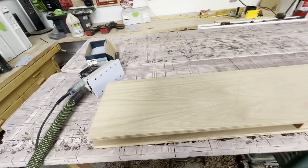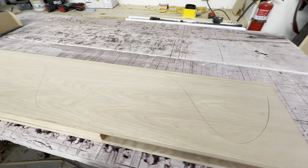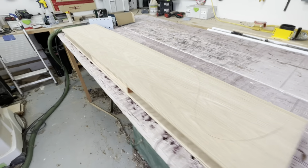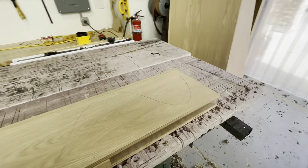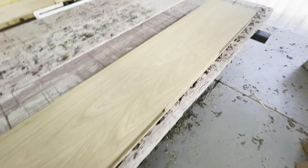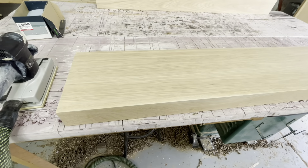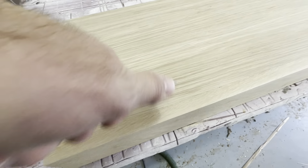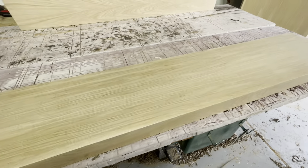All ready for the finished sanding. I'm going to use 150 grit. With Festool Granat on white oak, that's where I want to be — it's a pretty hard solid wood, it'll feel really smooth, and 150 grit still lets it take in quite a bit of color. I've got the pencil writing on there as my indicator of when enough is enough. After sanding, I'll take my air compressor and blow out the sawdust — you can see in the grain how it opens up. Getting that sawdust out helps the stain take better and makes sure there's no dust in the finish.